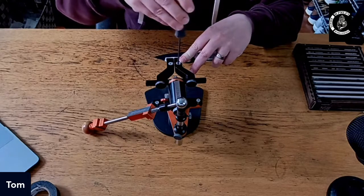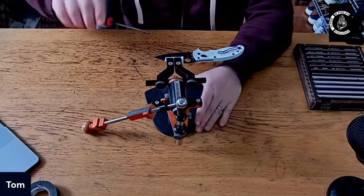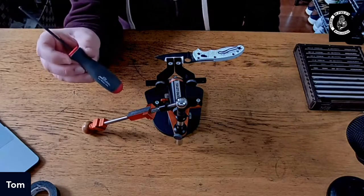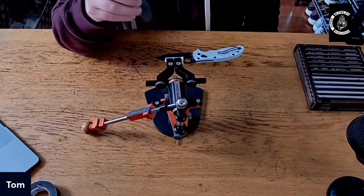The Hapstone uses a 3mm Allen driver, like a normal Allen wrench, not a Torx driver like you're used to working on with your knives. So get a good 3mm Allen driver, because you're going to have to crank these down, and you don't want something that's going to strip out. You want these to be really secure.